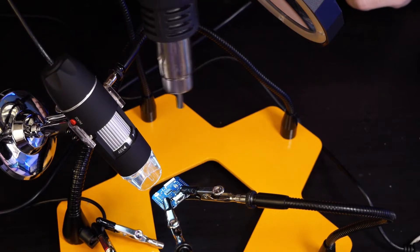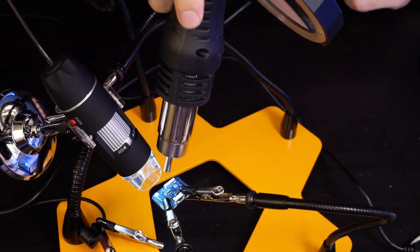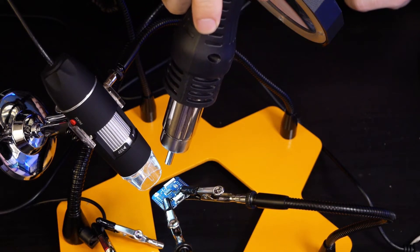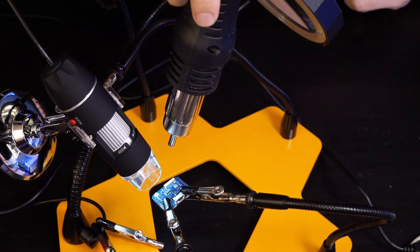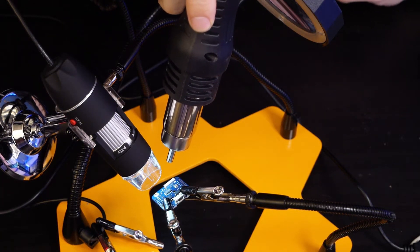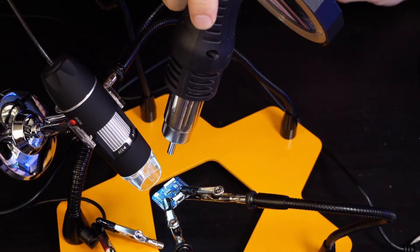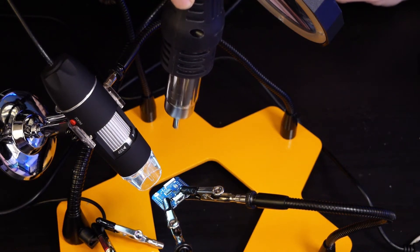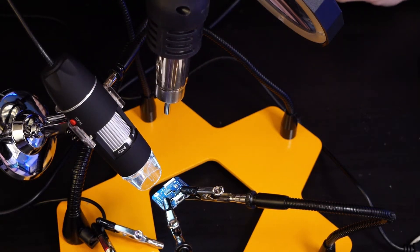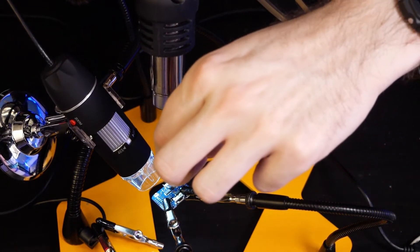What we're going to need to do is take this heat gun and when it's heated to the appropriate temperature, we're going to heat up the board just a bit while watching on the microscope to make sure that everything is okay and we're not just liquefying it and burning the board beyond what we need to. Treat this like a soldering iron — make sure that you're not applying unnecessary heat and point it only at the components that you need to melt. I'm using the microscope to occasionally glance and make sure that when the solder looks molten, I'm moving the components before I burn the board. A little bit of back and forth heat initially, and then some very specific closer-up heat to move the component, plus a second hand to hold a pair of tweezers to actually move it.